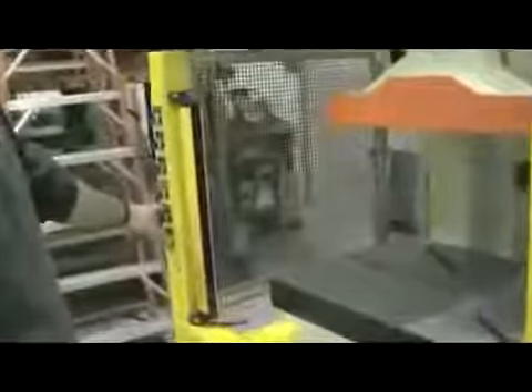When you select and turn on Swift Trip, if you break the beam and run your hands across the ergonomic button, press it to cycle one time. If at any time you don't break the light curtain and hit the button, the press will not cycle. If your hand is in the light curtain, the press will not cycle. If you need to see the motion, press it and it will cycle.